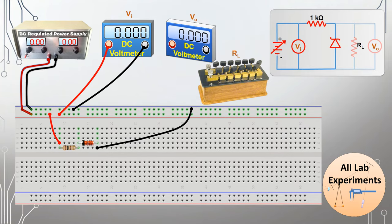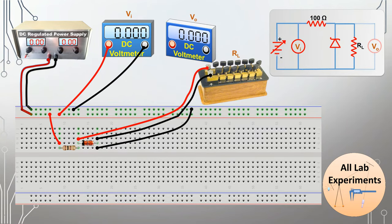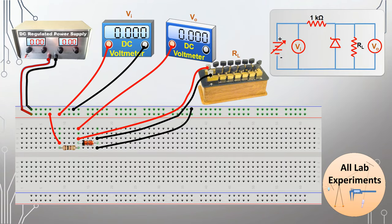In the next step, we can see that the load resistance is in parallel to the zener diode, so we connect the two ends of the resistance box with the two ends of the zener diode. Similarly, the voltmeter representing the output voltage VO is also in parallel with the load resistance or the zener diode, so we connect the positive of the voltmeter with the N side of the zener diode and the negative of the voltmeter with the P side of the zener diode. This is the complete circuit.